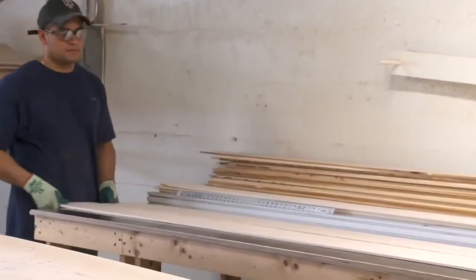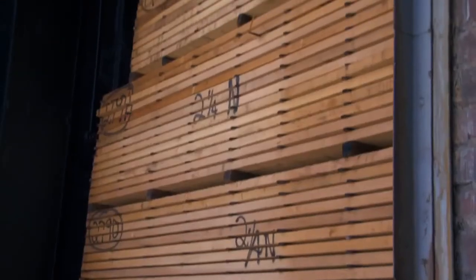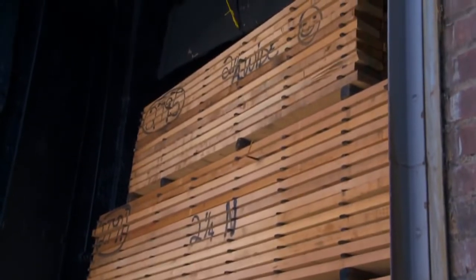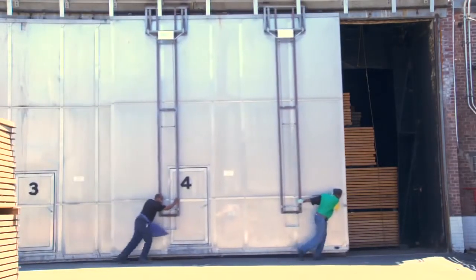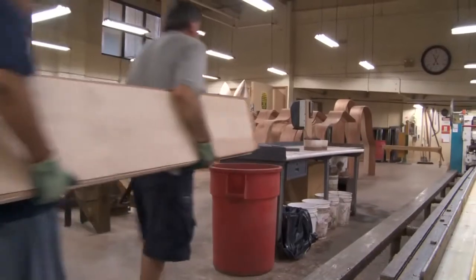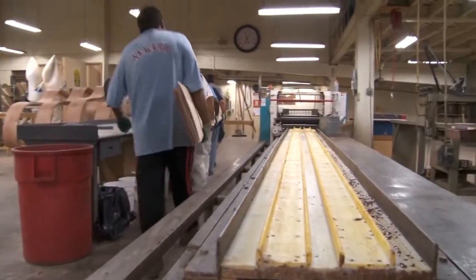85% of the piano is wood. We inspect every piece of lumber that arrives at our factory to be certain that only the top grade of each wood used will be built into every Steinway piano. The lumber is air-dried for up to 1 year and then kiln-dried to remove any tendencies for warping and cracking. Now our basic construction begins with the most basic and dramatic procedure of all, bending the rim.